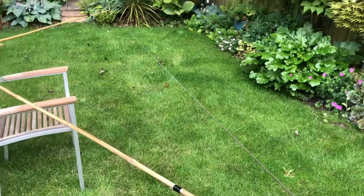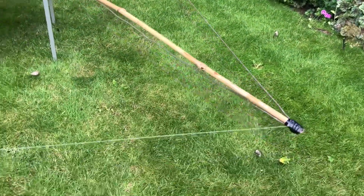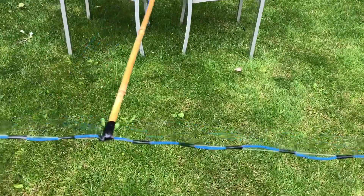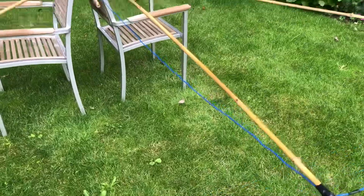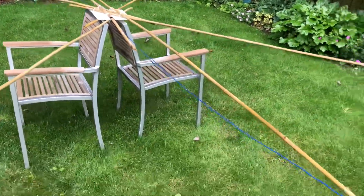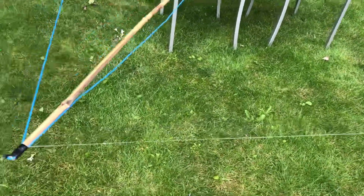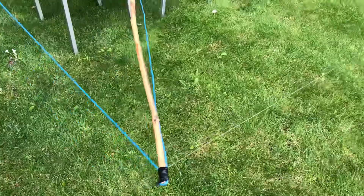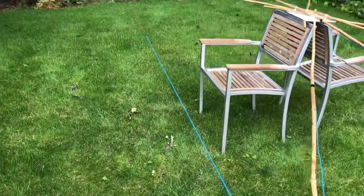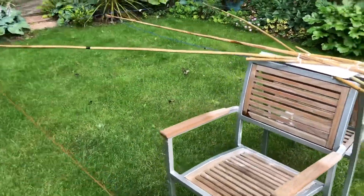The director wire goes along the front to the other cane and is just replicated on the other side. Here's some fishing line that supports the end of the driven element. These are the two capacitive ends, and again that cane supports the driven element going to the centre. Moving back to the Yagi, some more fishing line just to keep that side tensioned. This is the reflector — it's a bit longer than the director on the front and again runs across the back, duplicated on the other arm.